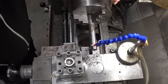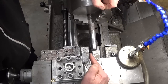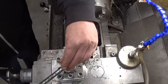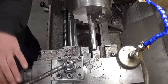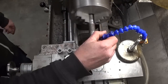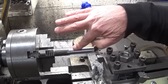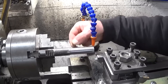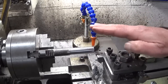I have to stop because the shank of my cutting tool holder here is touching the workpiece. That's not good! It could well be that we're getting somewhere. When I feel the surface, you can feel — but when I feel the surface it feels a little bit wavy. I think that's bizarre.